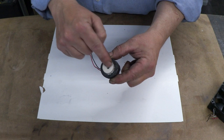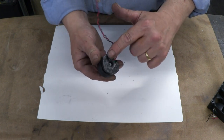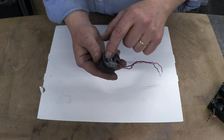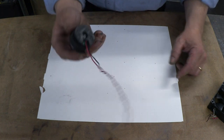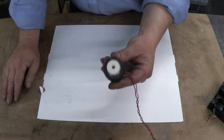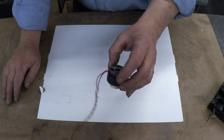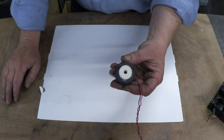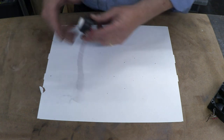I've glued a little bit of plastic on there so that I've got a centre to glue everything to. To modify this from a motor — because these are brushless motors — all you do is identify the two ends of the coil and solder on a couple of wires, and that is now a generator. Lots of videos on how to do it — just follow those and prepare yourself a little motor-stroke-generator, which is what that is.